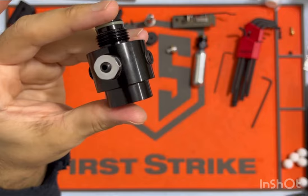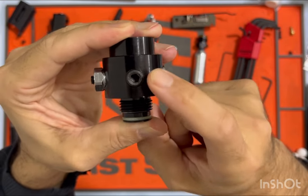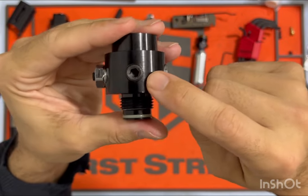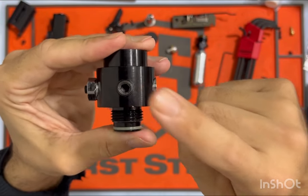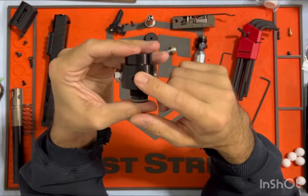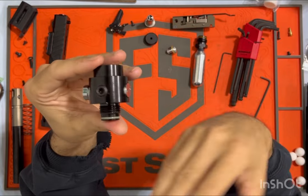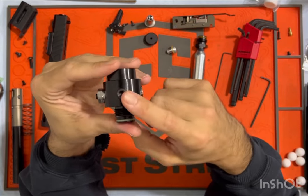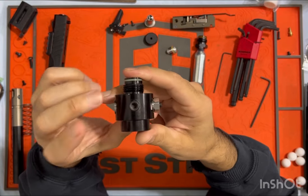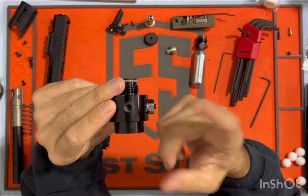But here is my OCD taking over. This screw on this side is not metric — it is 3/8-24 national fine thread, which is just standard fine thread. This was where your 3K or 3000 PSI burst disc was. Now, for our intents and purposes, it is not a necessary evil here. Your marker is never going to reach 3000 PSI before an O-ring gives. So it's something that we don't need. I'd like to thank Alex Less Lethal from the Facebook group for doing the legwork on that.